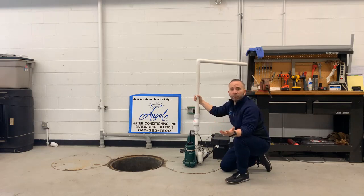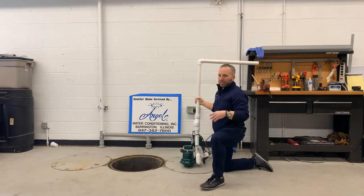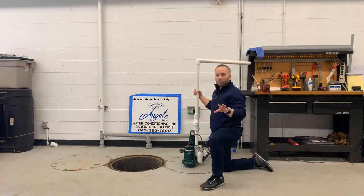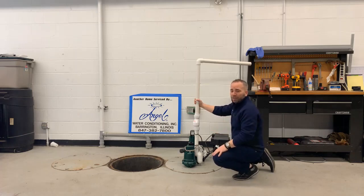Going back to the example with Tom McCarthy — he had so much aggregate water that when we got a pump going, it couldn't keep up with the volume coming into the pit. He elected to get two pumps with two pipes to take water outside, and a big battery backup system. A good thing to remember is that the Zoeller pump should be replaced about every four or five years, depending on how much water you get.